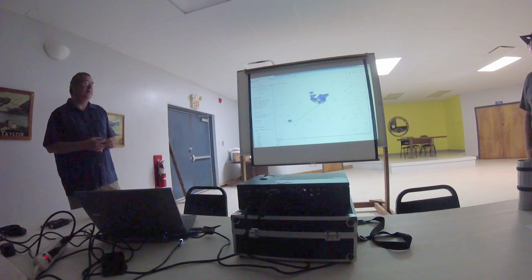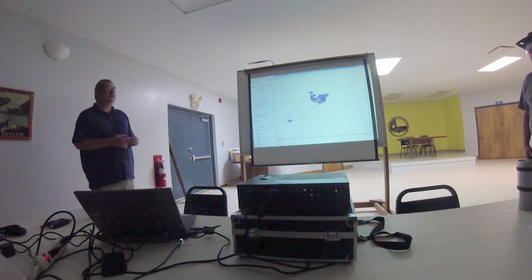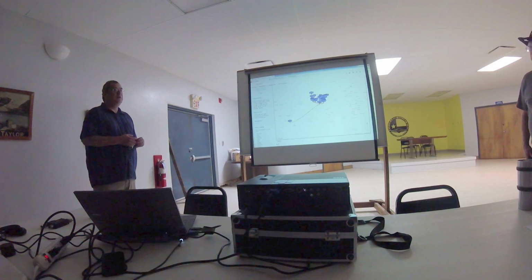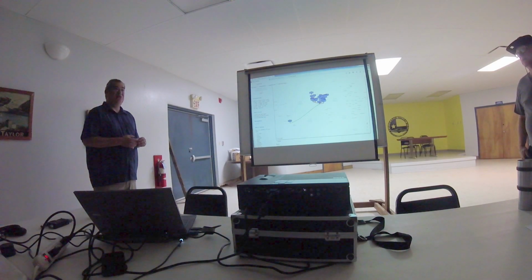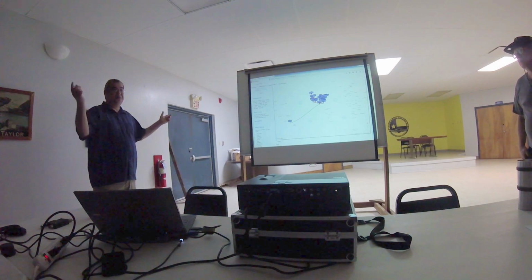Okay. The other question I had is on that counterpoise. The counterpoise you show as being like 3.3 feet for 20 meters. But if you go up to 12 meters, do you have to shorten it or just leave it alone? Well, you should, but really you don't have to. You really don't have to for this kind of thing.